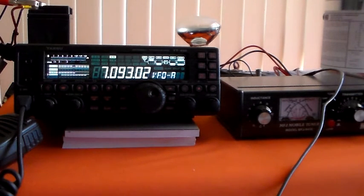It's been done since transmitters existed, I think, and certainly I've done it many times, many decades ago, playing around with 807s and 813s and that sort of stuff. Actually, not so much 813s because you need a lot of light bulbs, but 807s, 5763s, 10 watts, anything up to 100 watts, a couple of 100 watts, a light bulb or two is a very good dummy load. I'll let you see what's going on.